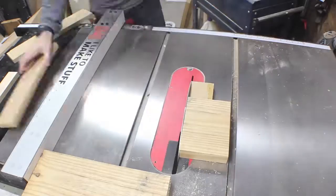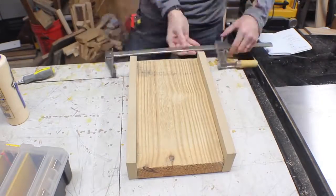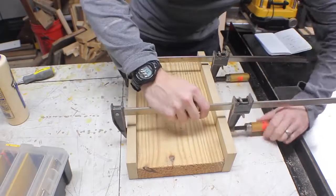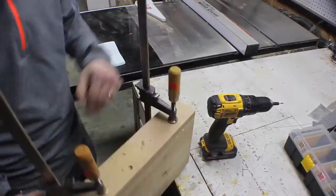Since the cabinet is so much deeper than the door frame that it's in, I had to build an offset to hold the latching mechanism. I used some 2x8 and some MDF to make a little shelf that I could screw in behind the door frame.